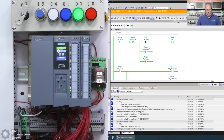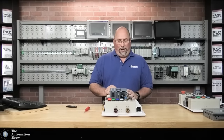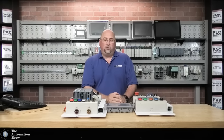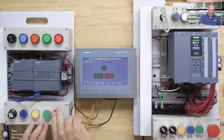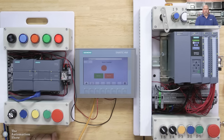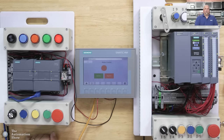If I was just using the output from the PLC it wouldn't trip. Let's start it up again — and that's it. Now the next thing is to add the HMI to the network and add some buttons to it. I've brought over the 1200 and the basic panel from previous shows — I've got the start and stop still working on the 1200. Now let's see if we can get the 1500 to also use the screen by copying and pasting buttons.